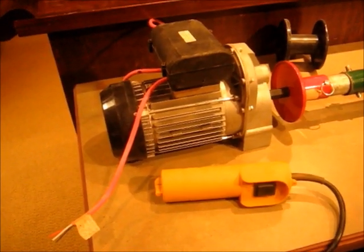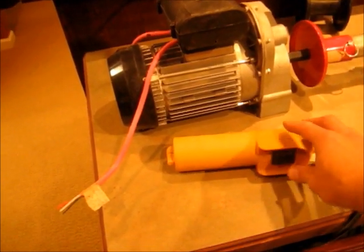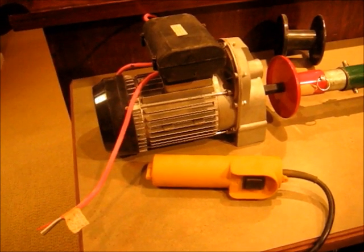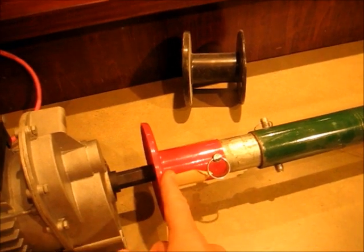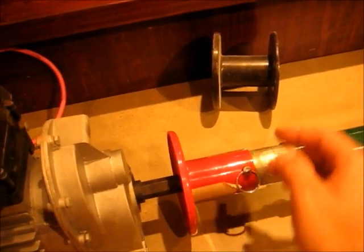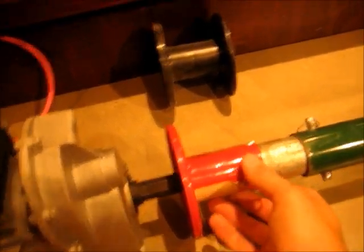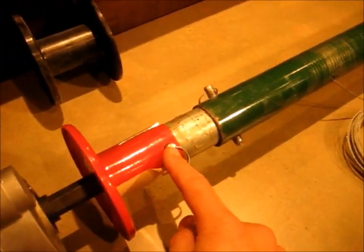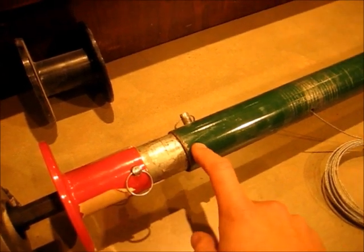To raise and lower the ping-pong topper, I used this winch motor. It had a controller like this that I took off, and I'll show you what I replaced it with later. It had a metal pulley on the winch that I cut off one half — it used to look like this one. I cut a split in it and then used these cotter keys to connect it to this long pipe.